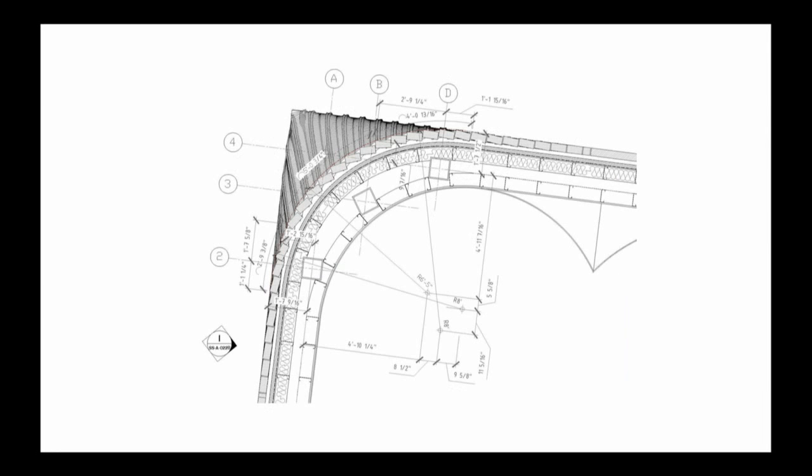And the decision was, we don't want to cut any bricks at those moments because we'll end up with some little slivers or some big fat joints. And so there's a whole process that we went through with them, both in developing a Grasshopper model that populated the wall of brick for us and worked on the angles, but then going in and massaging specific areas in the model where we're expanding the mortar joint just a little bit to nudge it, or we're tightening the joint a little bit to shrink it to get the final resolution point in line.